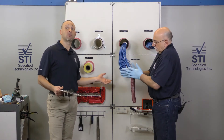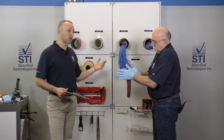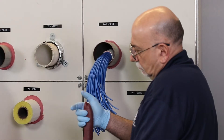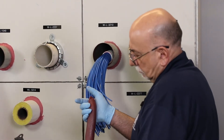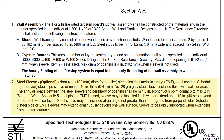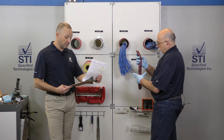It's pre-caulked already, as you can see. We just wanted to make things a little bit easier on ourselves here, but you definitely need to deal with the annular space around the periphery of the sleeve, as well as what's going on inside, which is what the putty is going to help us out with. This sleeve can actually be at a 45 degree angle if needed.